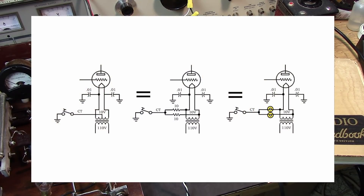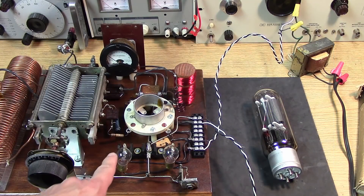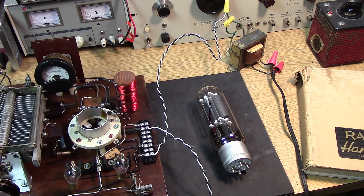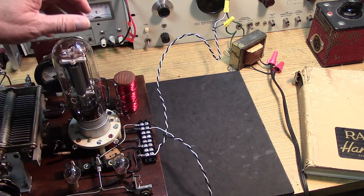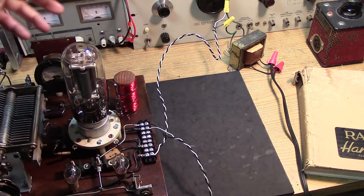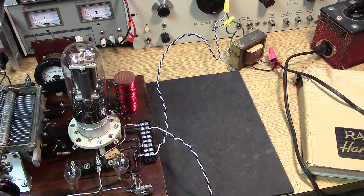Because hams were very industrious and frugal, for my two balancing resistors on the filament I'm using a couple of automotive bulbs as resistors. I do have a variac hooked up, so we'll be able to bring this up slowly in voltage. The first thing we need to do is plug in the tube. As you can see, it has these short pins and a little stub — this is known as a bayonet-style connection. You push the valve down into the socket until you find the groove, turn clockwise, and now the tube is bayoneted into the socket. Next, we're going to bring up the filament and hopefully get this thing to light.